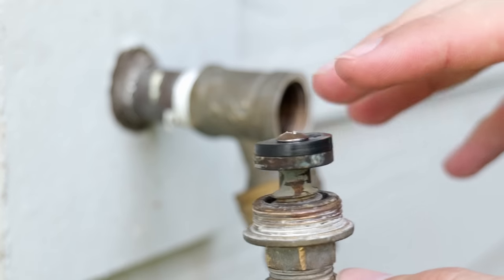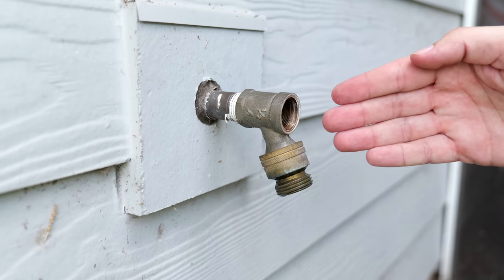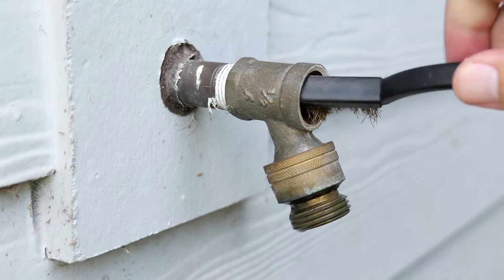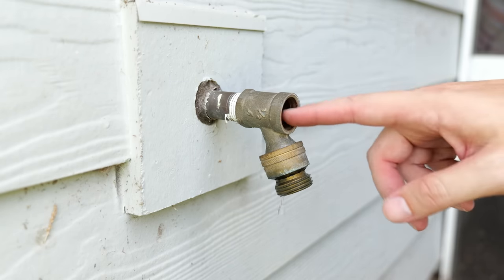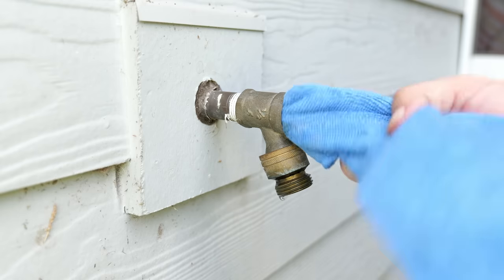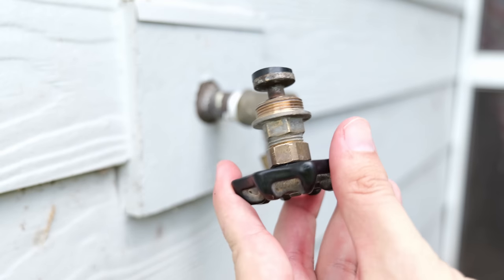Be careful not to over-tighten, which causes more of a bowl effect — you want it nice and flat on top. While the valve is still out, this is a good opportunity to clean it up. Most places in the country have hard water and you'll have mineral deposits inside. If you have a water softener that'll help, but it's a good idea to take a wire brush and clean up those threads and inside the body of the faucet. Spin it around until the threads are nice and clean and starting to shine again, removing those deposits. Wipe it down with a towel, and do the same with the threads on the valve.